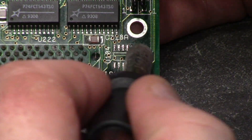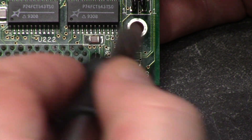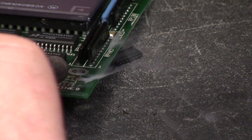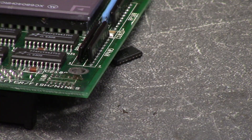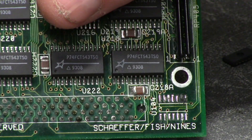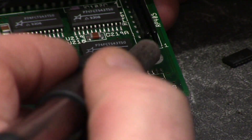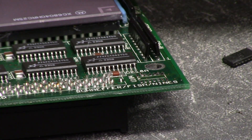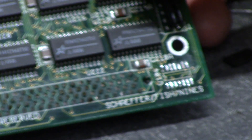That one's the questionable one because these last three are gonna require some magic flux. Because when the flux activates it turns into this acid charcoal stuff and ruins pads — just like it's doing. Really just crusts it up. The other ones, as you can see, perfect. These top two over here, not perfect. I don't think they're in use but it's a quad layer board so I don't know. See the two skaggy ones? That's what I'm trying to get out of there. The problem is it's just hard — that's a freaking rock. So bingo, look at that.